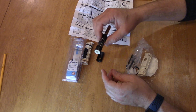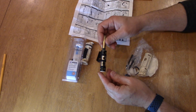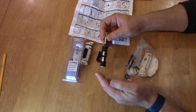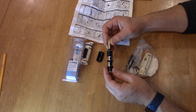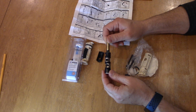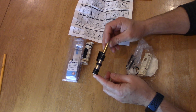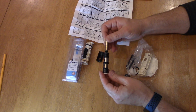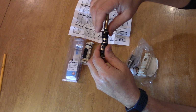And remember, do buy the original Moen parts, because if you look online, a lot of the knockoffs have issues with the hammering effect, because you don't know if your plumber put in the right air gaps and so on into the piping, and then you may get this hammering effect because the valving isn't right. Moen does a nice job of valving, so you basically get the proper part. Those are things that you can just clean up, have it well lubed.